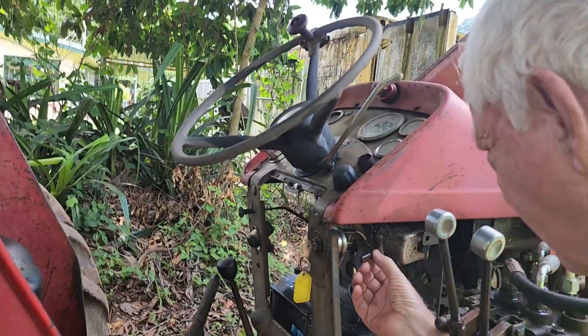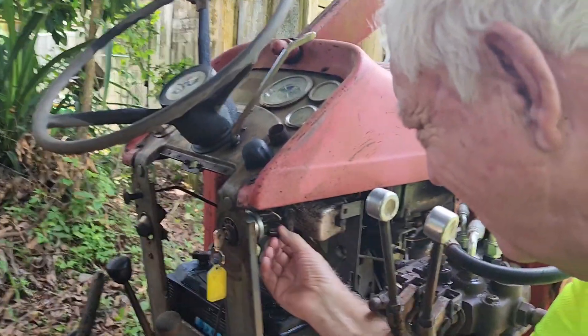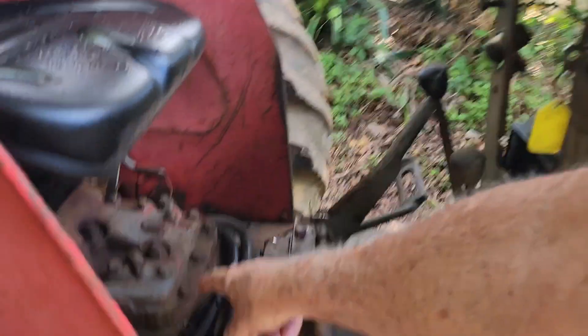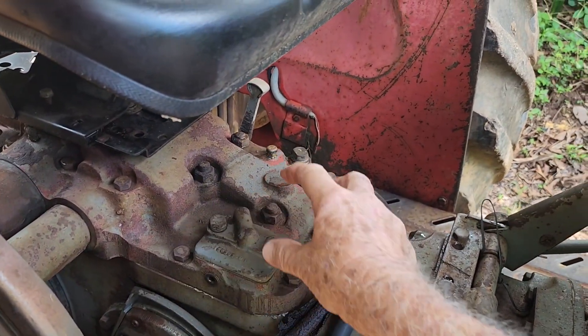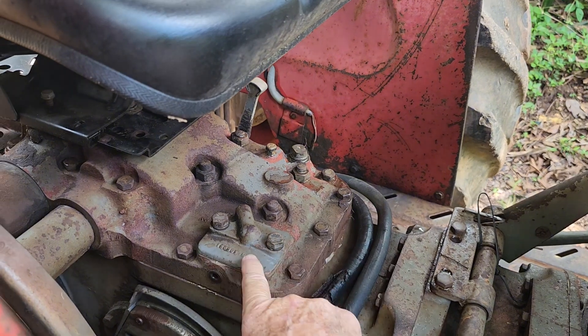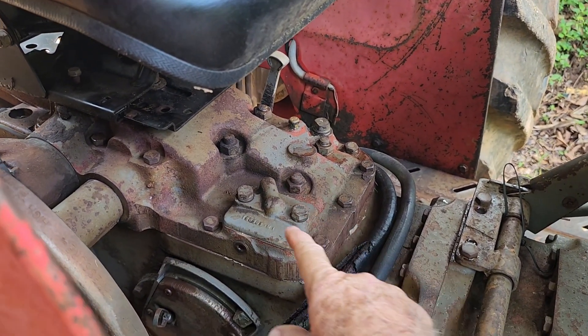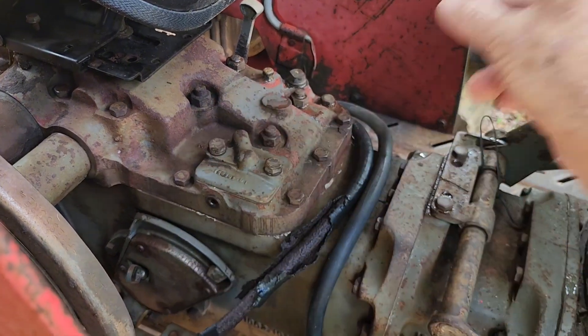If the pump is pushed, the oil will come out. I wanted to check it — I can take those two bolts out, take that cover off, and in the middle is a standpipe that comes directly out of the pump. The oil comes up there, then it gets diverted back down and goes to the system.